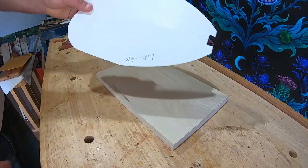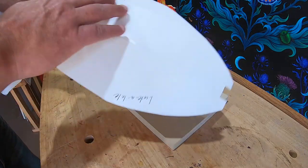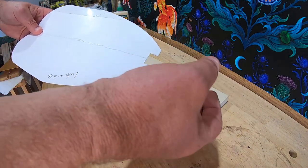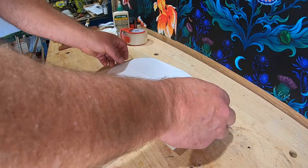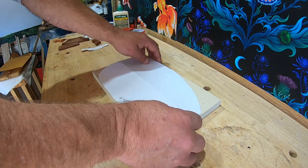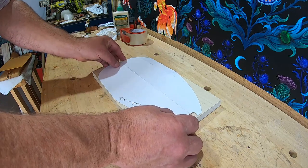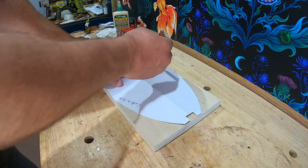I already have a template I made a long time ago for these. Basically here's the body — it's a baritone lute shape. It's going to have a notch in the front so when we go to countersink the neck into it, it'll hold really well. The worst thing you want is to build something and have the neck break — done that in my earlier days. I'll get it centered the best I can and trace out the pattern.